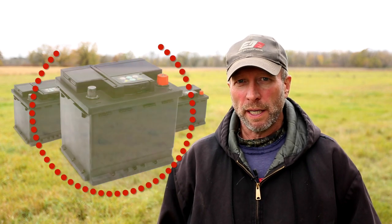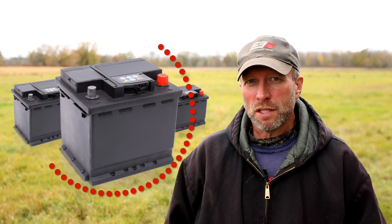In a remote situation where you might only be grazing during the summer months, a battery-powered unit is often adequate. If you're using a battery-powered unit, we strongly recommend a deep cycle marine battery. A lot of folks will have two deep cycle marine batteries and a battery charger back in the shop; they'll just rotate those batteries on a regular schedule. The most common recommendation is about once every three weeks. If there's not a lot of vegetative load on the fence you can go four or sometimes five weeks, but don't stretch it too far to the point where animals start violating the fence.